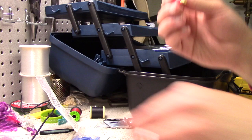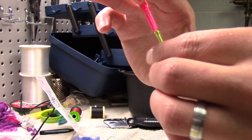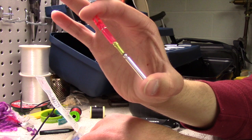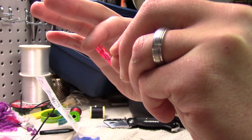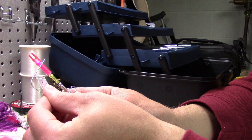That's connected. Now we just have to do the same for the battery — although we're not going to bend back the battery nipple. Just push everything in, make sure it's all as tight as possible. Before you crimp that battery — it's by far the most expensive part of this whole thing — just double-check again with your paper clip and confirm she lights up. This is a fully finished product you could put in your arrow right now, but there are still a couple of steps I want to do before we take it out to the woods.